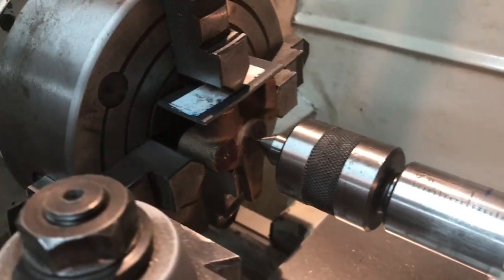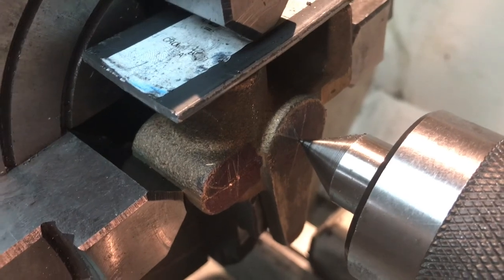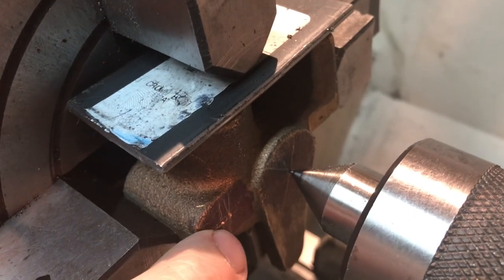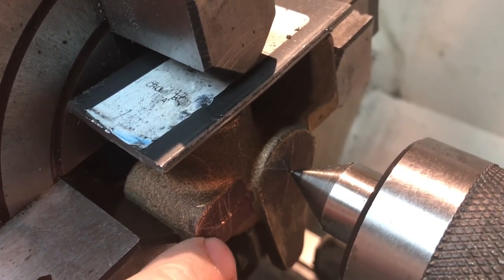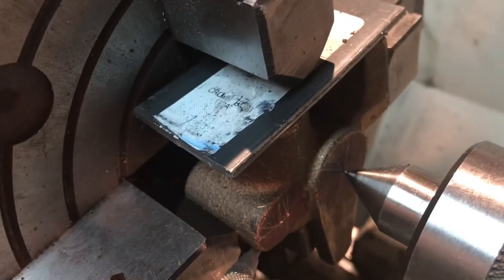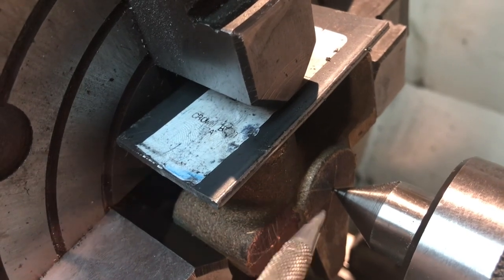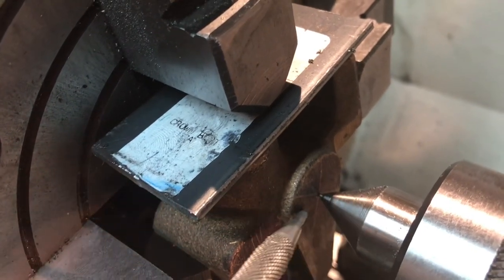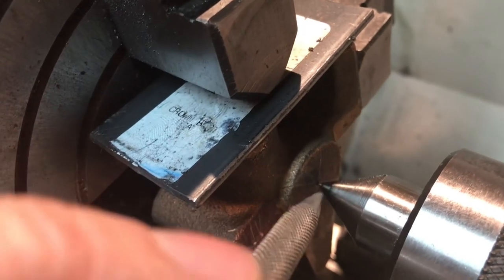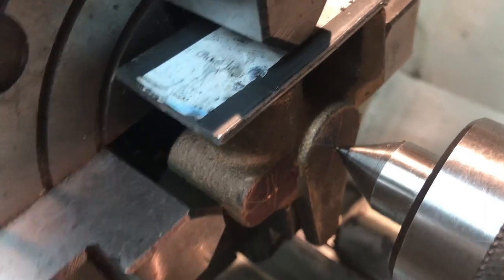For this step, I've carefully laid out the centers of the various holes. You can't see the one at the top because it's hidden behind this piece of reinforcing metal. This is the original center distance where I would be drilling a hole if I was using the split casting. But instead I'll be using the split cotter, so I'm offsetting it. I'm using the rotating tail stock — I've placed a center punch hole after carefully marking out where the center is. This is the center of the pivot where the hole and cone will be made. That's the first thing I'm going to do to this casting.